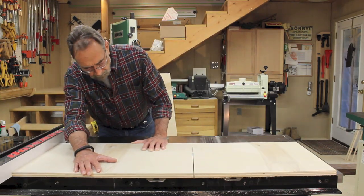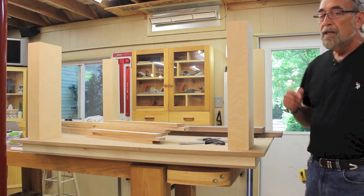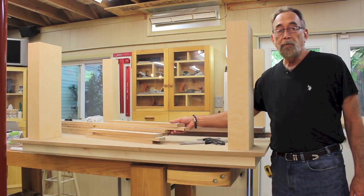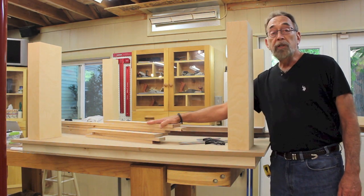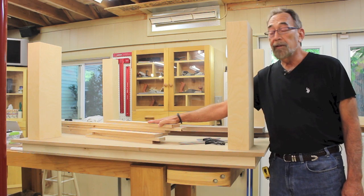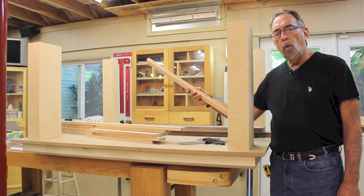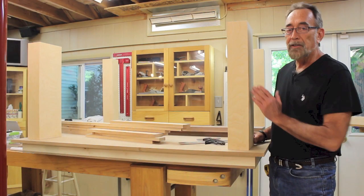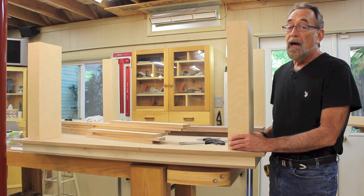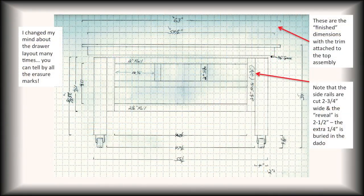Since I had the regular blade back in the saw, I went ahead and cut out a few more parts too. For the face frame, I was able to get a good deal on some birch stock. I milled it square, put it through the planer until I got it just shy of three-quarters of an inch thick. I wanted the thickness to exactly match the plywood so I'd only have to cut one size of dado in these pedestal leg assemblies. I used the SawStop to rip the pieces to the widths shown on the drawing.